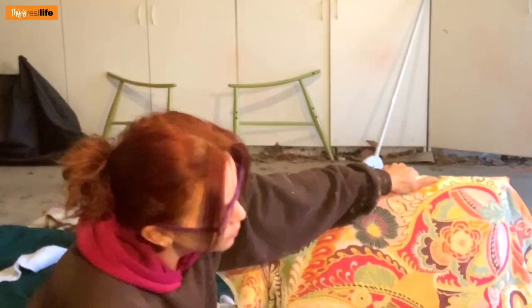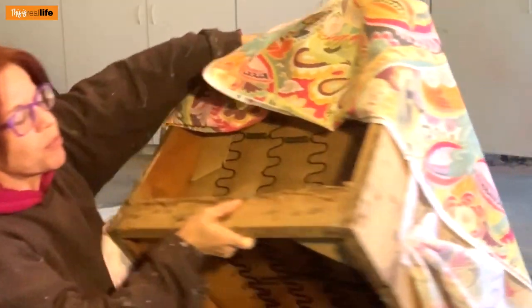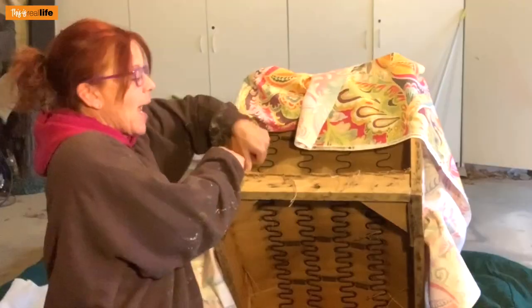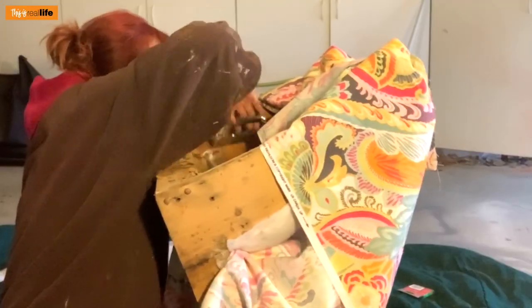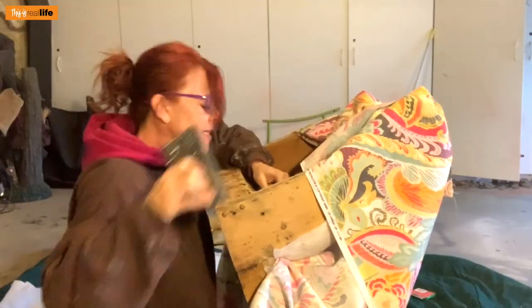I flip it and do my holding staples, then flip back and start tucking everything into place. Trial and error — shove it in, fold it over, staple it down. I can then take my handy tool and start shoving the fabric in, keeping the seat tight, tight, tight. This is where people are going to be sitting, so if you have loose fabric you'll get wrinkles. I'm shoving it in and pulling from the back side, pulling it tight and stapling to the back.